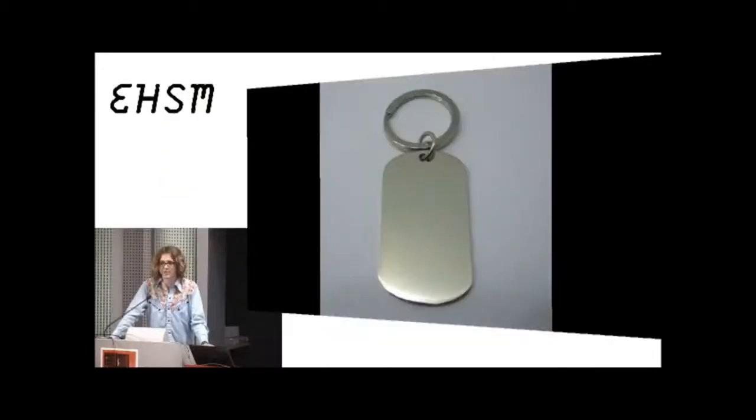She was trying to get a key ring engraved — pretty simple task, one would think — but she wanted to engrave some mathematical symbols. The engraving shops she went to, the kinds of shoe repairers and locksmiths, all told her they could only do letters 0 to 9 and A to Z, and maybe in Germany some accents, but no mathematical symbols. Those places had a stamping machine for pushing hardened steel letters into the surface, and they only had a set of 30 or 40 stamps — that was their limitation. Other places had CO2 lasers, quite popular, lots of hackerspaces have them, but they can't engrave into steel or metal at all — they could only mark anodized aluminium or coat surfaces in sintered black ink.